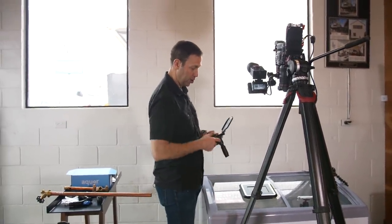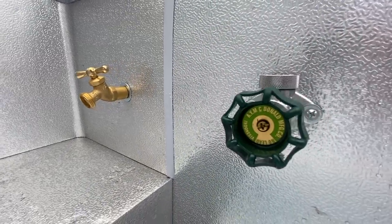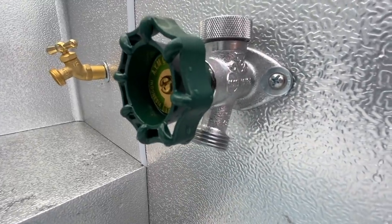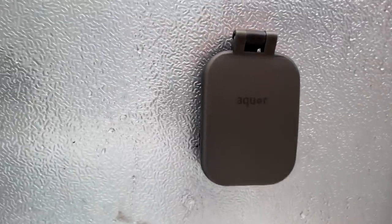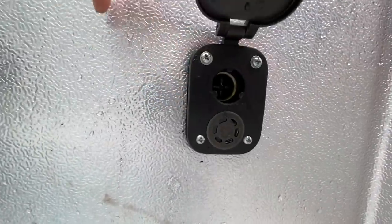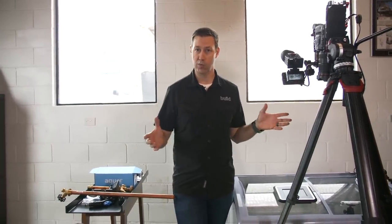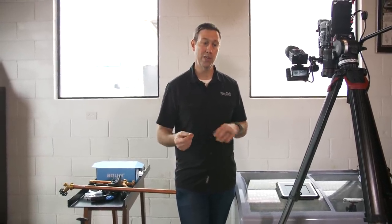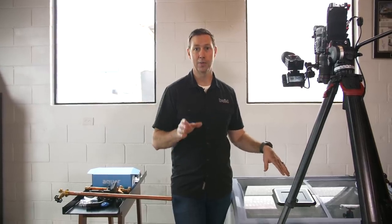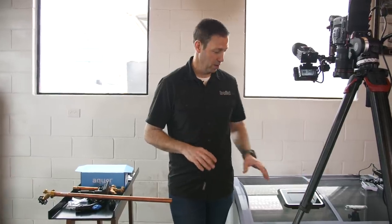In this freezer I've got three hose bibs set up. I've got a totally typical copper setup with just a brass hose bib at the end — non-frost-free. I've got a four-inch brass frost-free, which would work generally pretty well for the South. And then I've got the four-inch Aquor, which is stainless steel. Stainless steel is eight times less conductive of heat transfer than brass. Here's what I've got going on — three of these coming into a freezer.